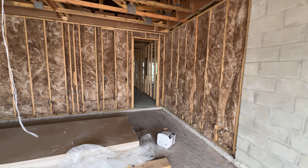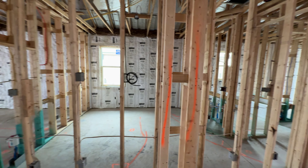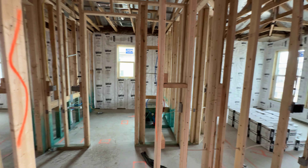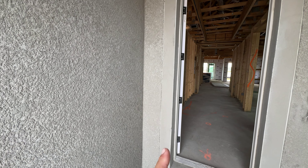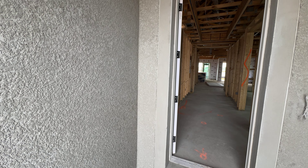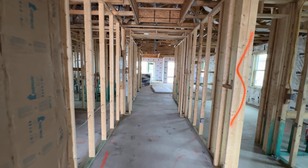We're in the garage right now. This is an installation stage, so it's getting ready to have the board hung. A lot of the things I like to do is take my six-foot level — you always want to make sure you've got a six-foot level — and make sure that all the studs are plumb and level, because that's obviously going to affect the way the drywall is hung. You also want to put your level at the block stage after it's blocked up and make sure that the doorway block on each side is plumb — dead center on that level, not a little bit to the left or right. If it's not, it's going to throw the whole door off and you're going to have issues from there forward.